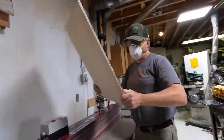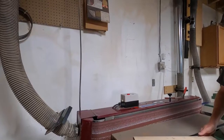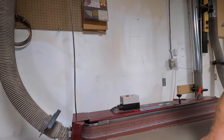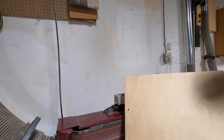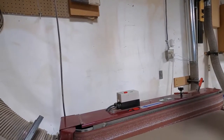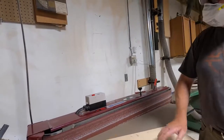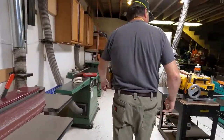Can you imagine planing it the old-fashioned way? It's very time consuming. There's about a 23-millimeter differential between the sides — look at the figuring on that. This is Baltic birch plywood — it never moves. I put the top on top of that and keep turning it, which allows me to get a taper going in both directions.